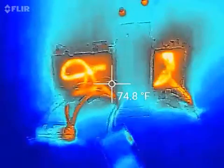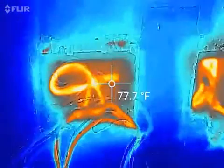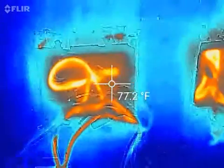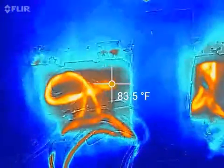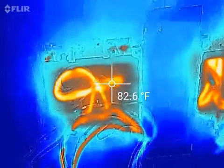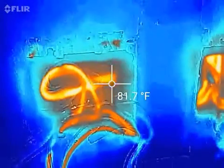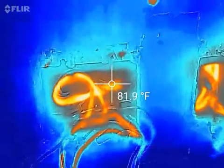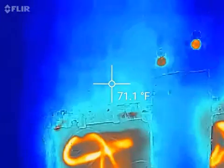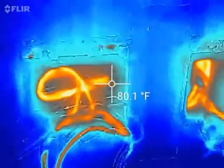We may have a little success. I pulled the motor dimmer out for the fan. Back here we had a little bit of a hot spot in the last video — the wire nut, a big wire nut, was really loose. I could reach in with needle nose pliers and turn it. The wires weren't arced or dirty; they were twisted together really well. But you can see 82 degrees versus 71 — that's only a 10-degree rise on the nut itself.